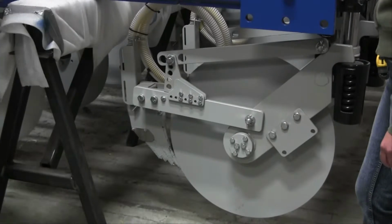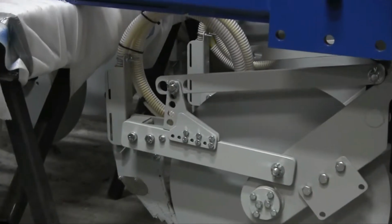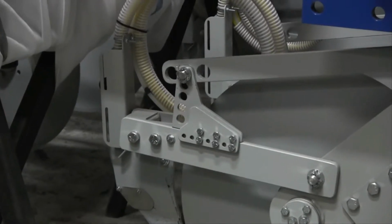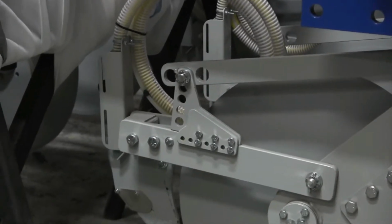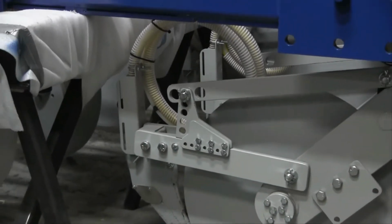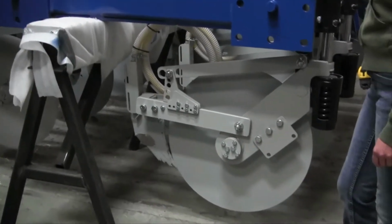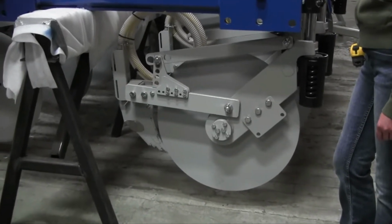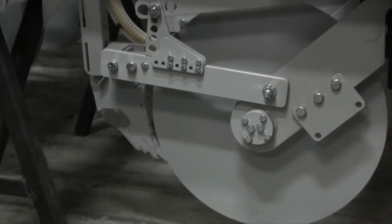And of course up here is the check valve holder, and those are made out of stainless steel. Recently we have changed the stainless steel there, and it's retained by a very heavy strain relief on the spiralite tubing. And then we run either 2 check valves or 1 check valve inside of that check valve holder, and we inject either 1 or 2 liquid products in 3-product injection. You can see the orifices and how they inject. This one's preset at about 7.5-inch banding depth.